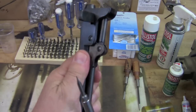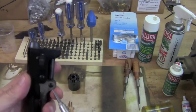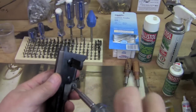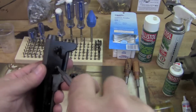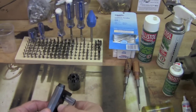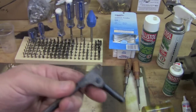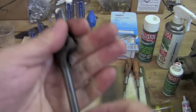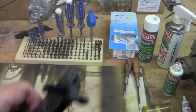The barrel group only has two major parts: the barrel itself and the rammer, and they come apart quite easily. You can disassemble the entire rammer by taking this screw apart. If you just want to take it off the frame, there's a screw right here on the barrel itself — pull that out and you can take out the entire rammer. If you take this screw apart you can take the actual rammer itself off. This is called the loading lever, and this is the rammer. Generally we leave the wedge in the barrel.